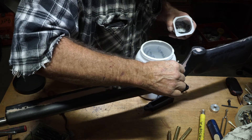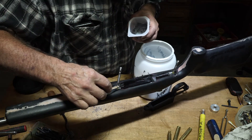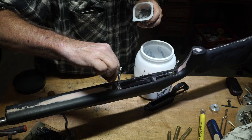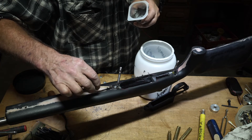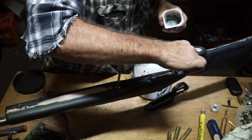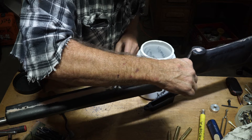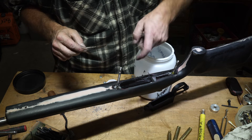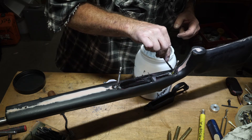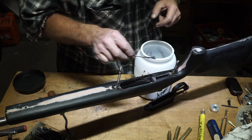I'll clean this up later — it's a little messy around these screws. All I'm doing with this is producing a surface to set this on, set it down to grade, set it down to height, clean up around it a little bit, and walk away. I'm filling in a void that I dug in back behind this when I fitted the pillar — I dug back in there and around, and I did that on both sides. That's not so much for the pillar as it is for helping to hold it — it's backing for the pillar. Because I'm combating lifting forces. That's the thing I'm most concerned with here — the lifting forces that are generated.